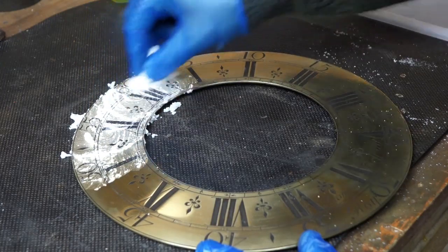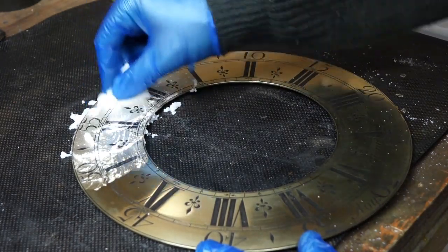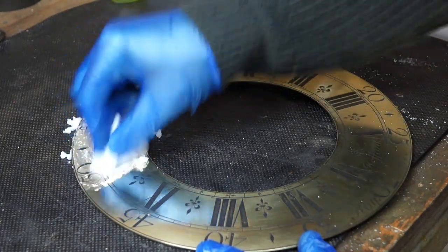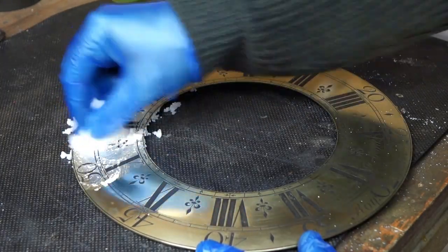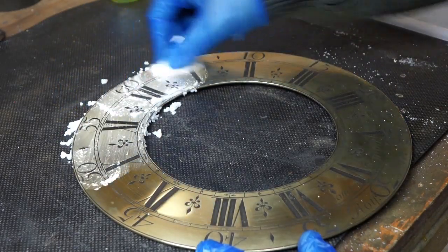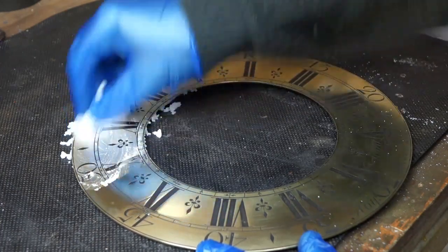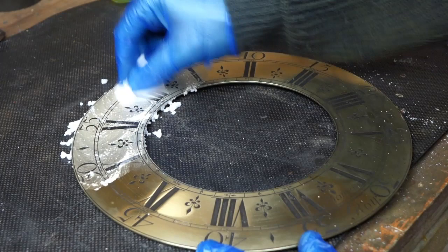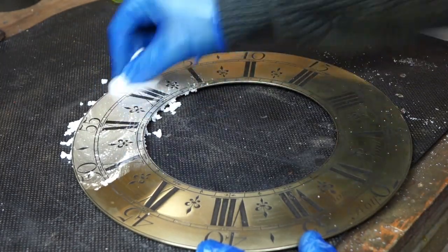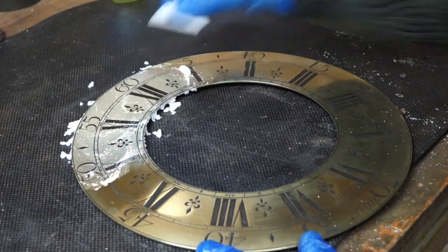You want to give it a good coating of silvering powder, make sure you're working well into the area. I'm coming anti-clockwise round. And as you can probably see by the camera, it's already changing - you're already getting a result. The more you put on, the more silver it's going to be, to a limit.